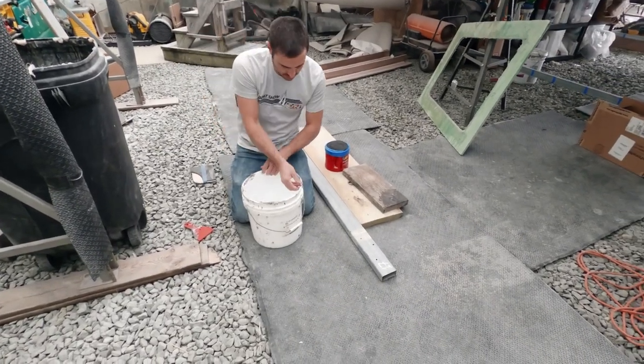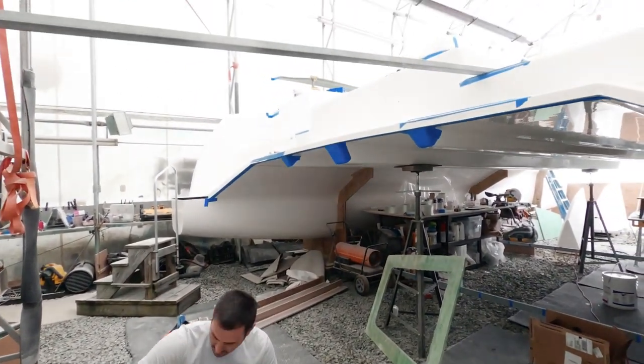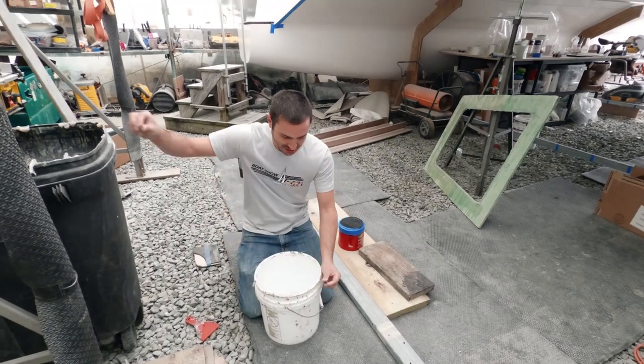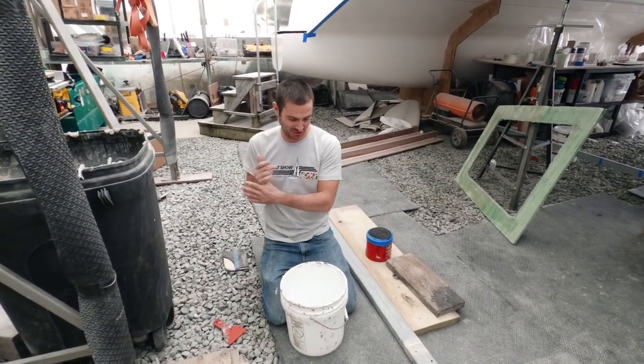Reduce, reuse, recycle — Matt is cleaning out one of our old buckets with old methacrylate still stuck on it, give it a good wash and we'll be ready to go. You can see the side deck hanging way up in the air to give good access. As I'm bagging up the methacrylate, Matt can start laying down a bead — we're getting good at this, much better about the process, and I got a little bit better at my math. Since this is just the two of us — when we did the transom we had Ryan and Bert — I didn't show it when we did the cockpit seats, but yes everybody, I now put the bag inside a cup and scoop into that. I've gotten much faster at the baggie, and hopefully I can get however many bags we need filled up and then join Matt to clean that bead down and get the deck in place.